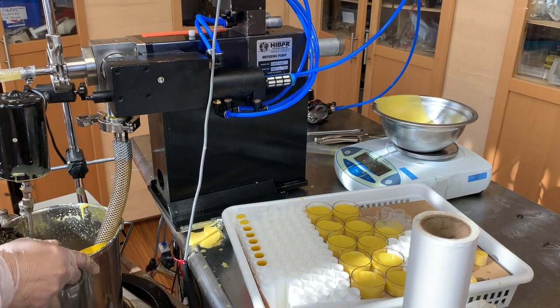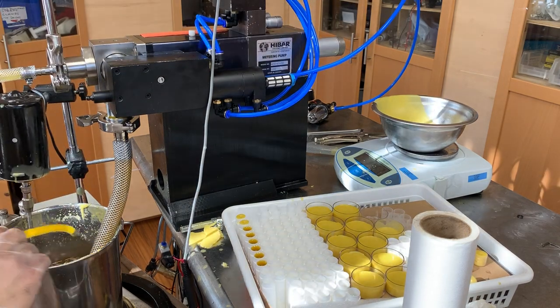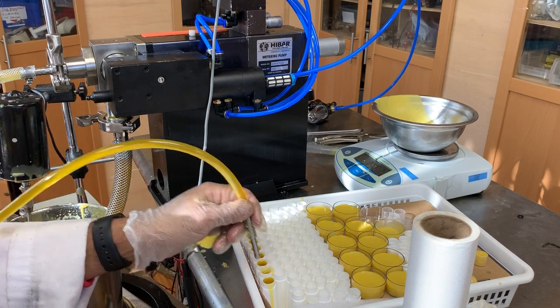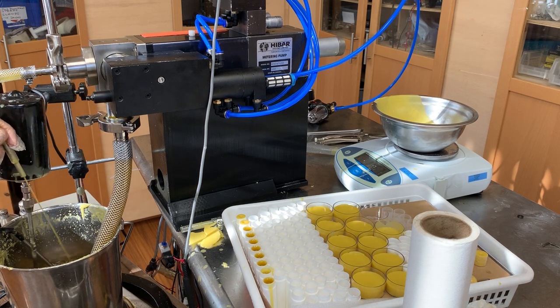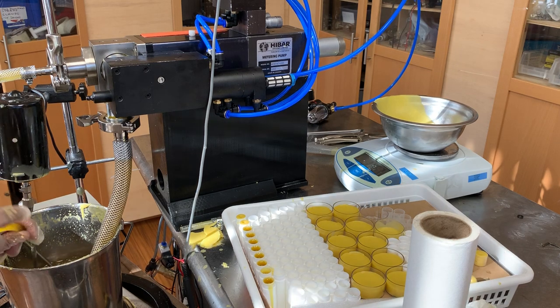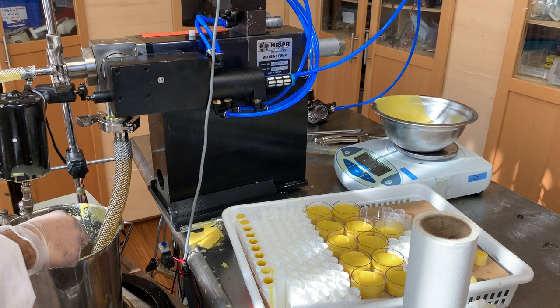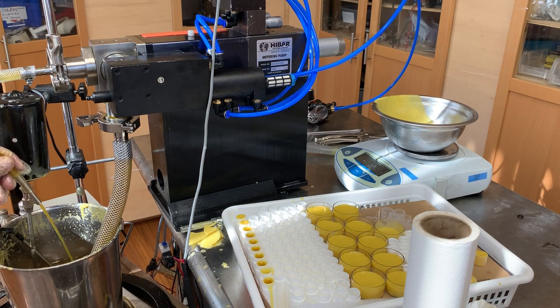You can see we're getting extremely accurate fills here. I'm going to open it up a little bit to get more of a crest. That's too fast — the speeds are going up too fast again. It's actually probably a restriction of the hose because it's cold, so it's causing the product to come out too fast. We're not going back to normal speed because I'm melting out some of the wax that's built up.